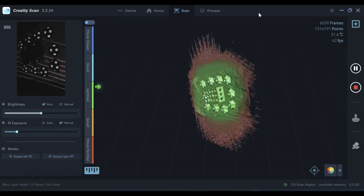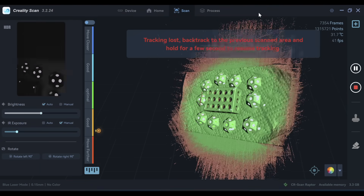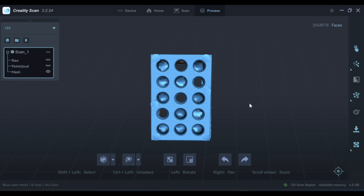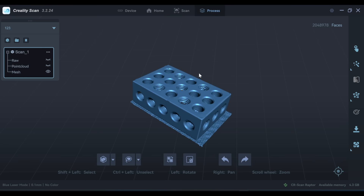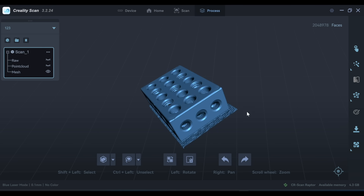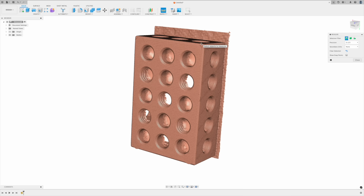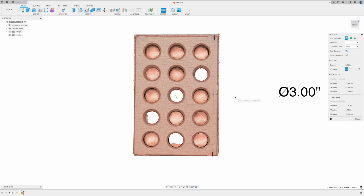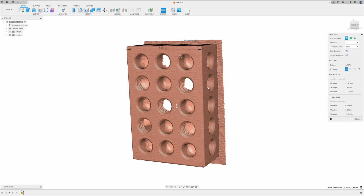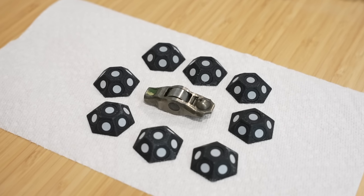It's pretty neat to see how well it picked up down inside those holes — I just needed to approach from a bunch of different angles. I did continue to run into some tracking errors, but they self-corrected almost instantly in blue light mode. Looking at the detail you can see the threads and the cylindrical holes, meaning I could use this to pick up interfacing parts. The dimensions checked right on three inches and three thou shy of two inches — pretty good results.